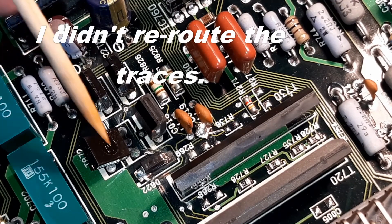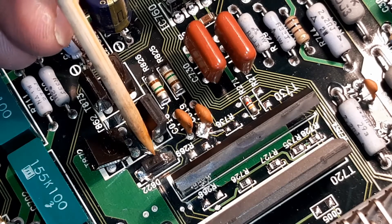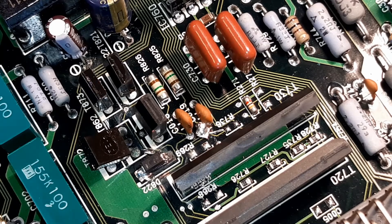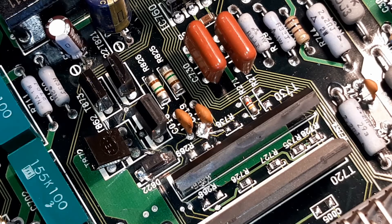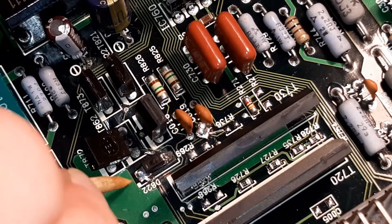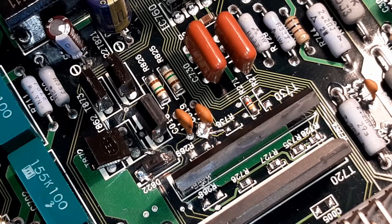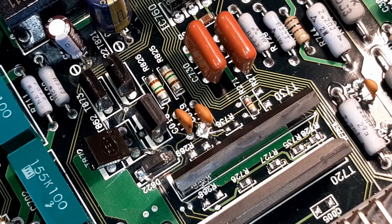There we have it folks — the diode is back in. It's firmly in place and I checked for continuity — we still have continuity. So what I'm gonna do next is clean up the board with some isopropyl alcohol and apply some epoxy glue. I want to protect the traces over here and stick the pads a little bit more to the board, and also cover these traces. I'm gonna check them for continuity again because I've rubbed over them quite a few times.